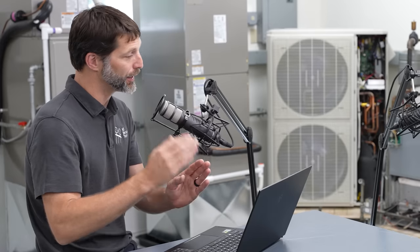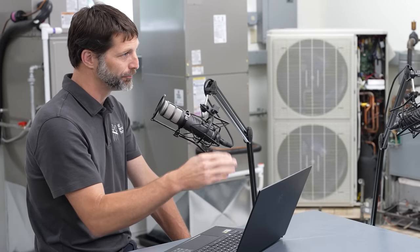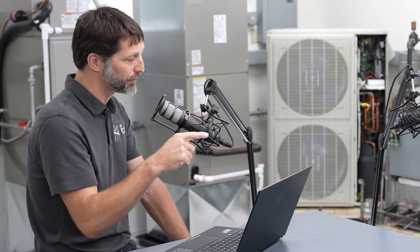The galvanized plate where it touches the metal — if you see rust there, that's most likely where you want to do your leak searches. A lot of manufacturers unfortunately make the tubes very thin. They increase the surface area on the inside with ridges to increase heat transfer, and they're just super thin. So any type of external or internal corrosion doesn't take much to end up having a leak at that location. That's why.